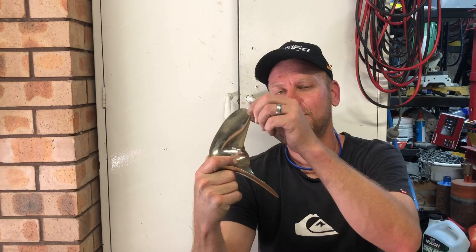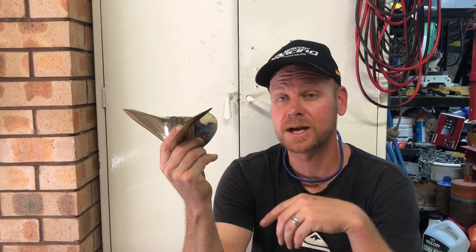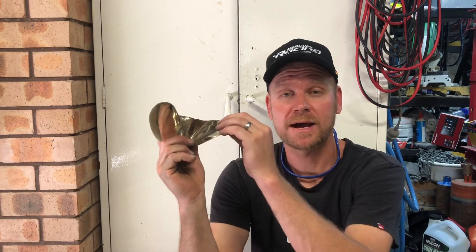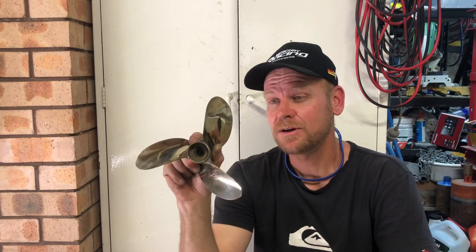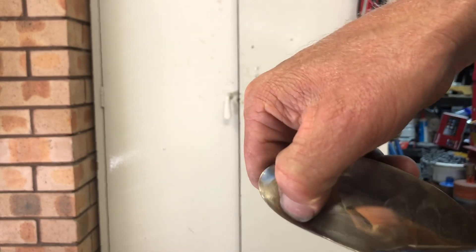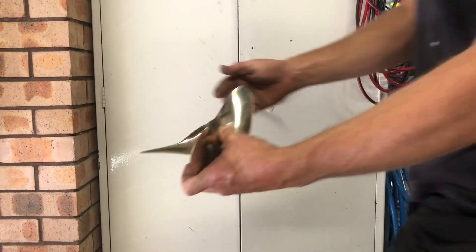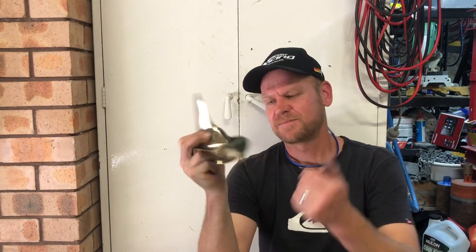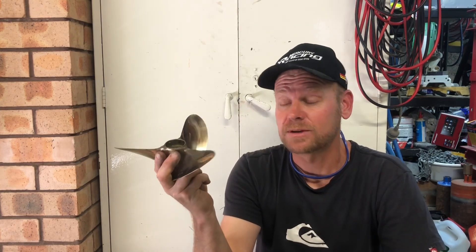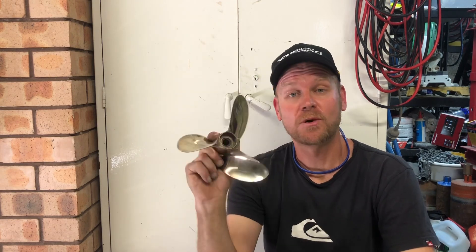That's finished. I've put a tiny cup on these trailing edges of the blades and buffed the backs back in — that's all balanced. There are plenty of videos on my channel about balancing propellers at home, so if you're interested in how to shape, thin, and balance props at home, scroll back through. As you can see, I've added a tiny cup just to that trailing edge area on the blades — it's very small. I don't want to put too much because the motor's already at max pitch. Excuse my sweat today — it's 43 degrees Celsius here in Australia. Next video we'll be testing this one. Subscribe for more boat-related fun — propellers, motors, services, stuff like that. All the best, champs. See ya.